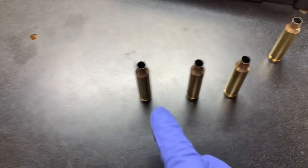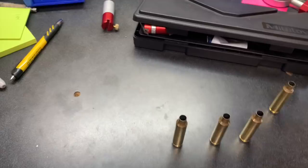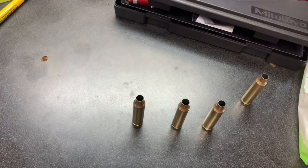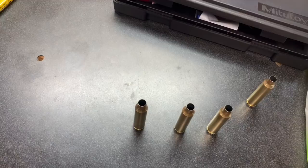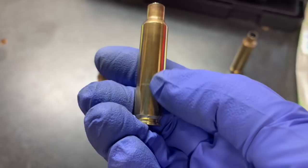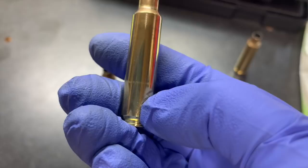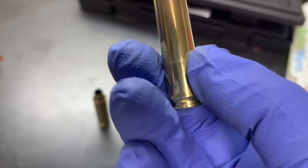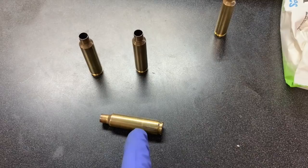So what's happening? Eric did a really good video during his annealing segment where he took a piece of brass, put it in a vice, and bent it a bunch of times until it snapped. To put it in simpler terms — have you ever played with a paper clip long enough where you bend it back and forth and after five or six times it snaps? It's because the metal literally work hardens to the point where it becomes brittle. That's what's happening with your brass. Even if you anneal, you're not annealing all the way down into the base — and you don't want to. At some point this brass is going to work harden enough that sizing causes a point all the way around the brass to become brittle and crack.